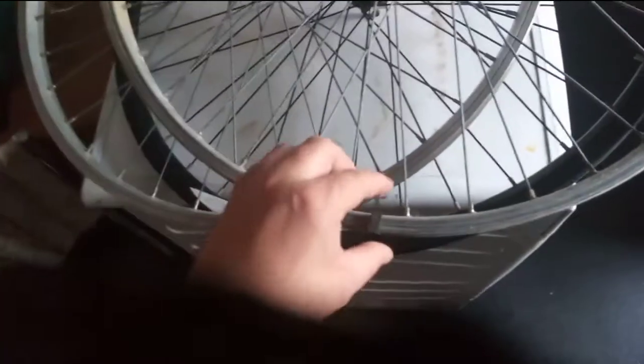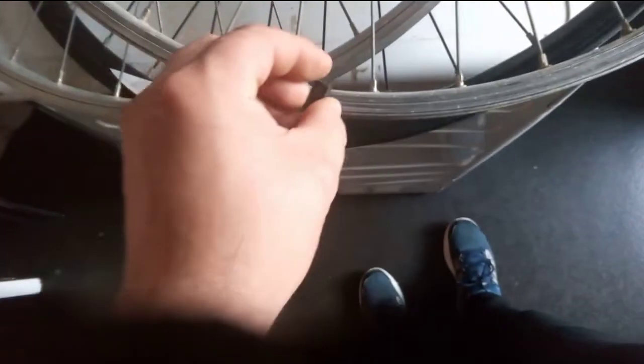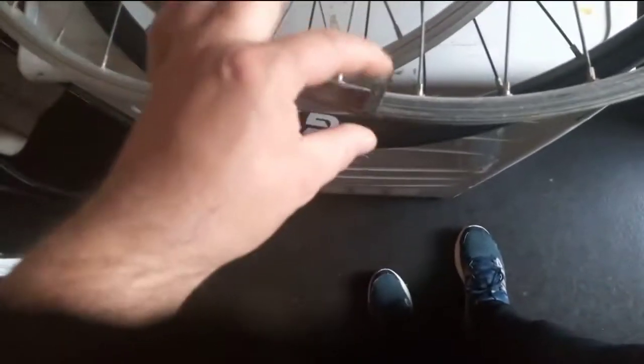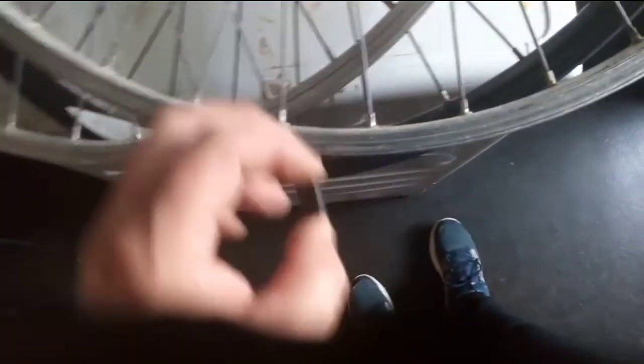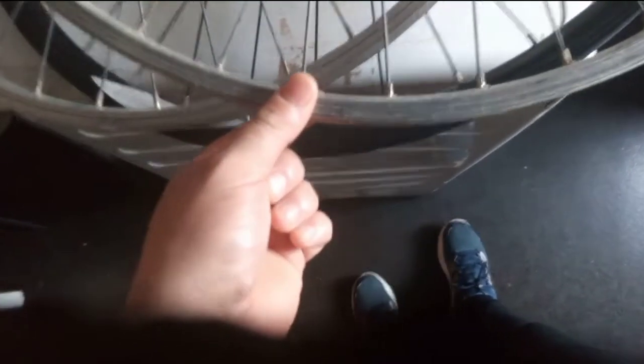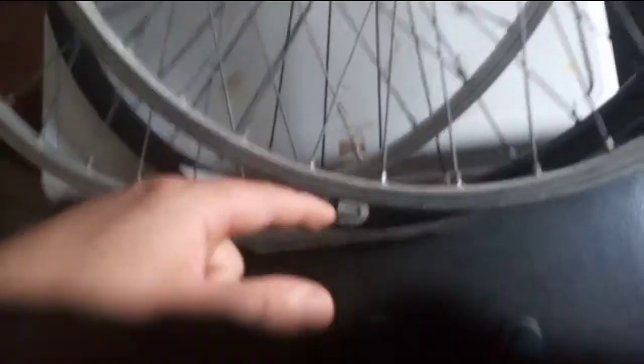So with the bike wheels — you find the join where the pins are, which makes it magnetic. You get your magnet and where it loosens, you cut it on that side. That bit goes in the dirty alloy pile, all the spokes come off into the steel or iron pile, and the rest goes in clean alloy — clean rolled alloy. So there's a couple of wheels there that need to be processed.